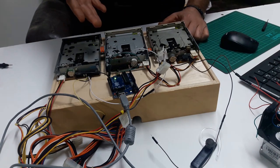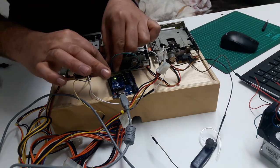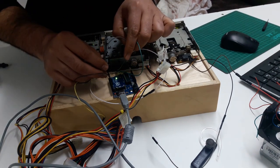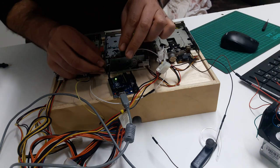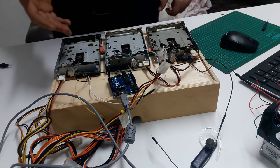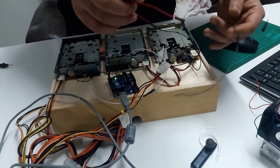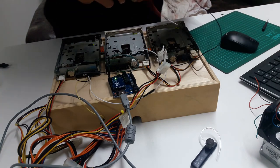Or you can also do as everybody does, which is they always tell you to connect the pin 18 to number 3, okay, and the pin 20 to number 2, but really it doesn't matter because in this program, which is MoppyPlayer, I already uploaded it to the Arduino. You can use up to 8 drives, which means it doesn't matter which connection you choose, it will always play music, and I will show you this in a while.